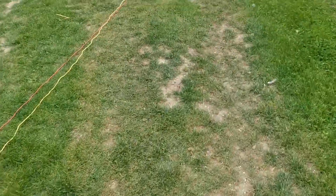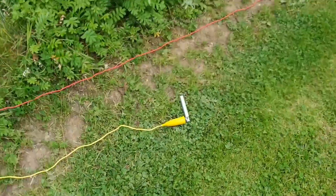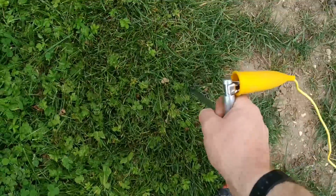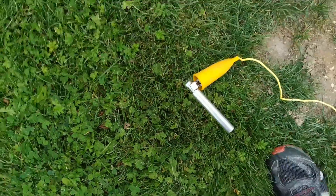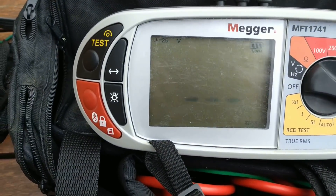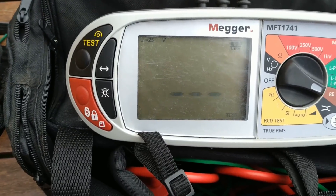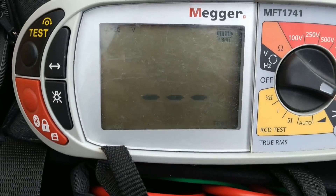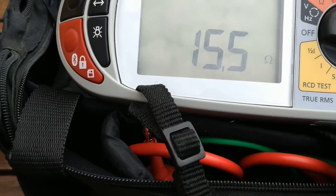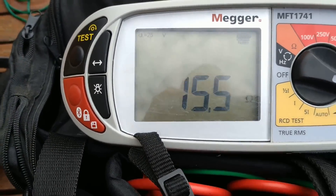Now we'll just have a look at where these temporary electrodes are placed. There's the yellow one, pretty much where I put it previously. We're going to move it to a slightly different position — somewhat closer to the testing device. The ground is rather hard as it's quite dry, but we'll just push that in. There may be some variation depending on distances, but the resistance of those electrodes isn't particularly relevant. The result is 15.5 ohms — slightly less, but again all within the realms of measurement error for this arrangement, so around 16 ohms.